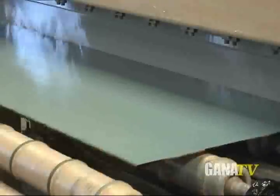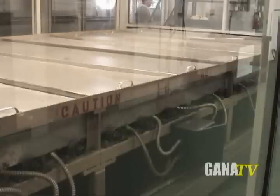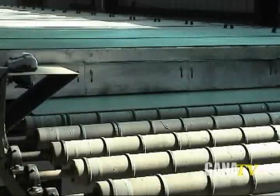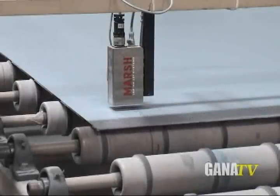An ultraviolet top coat is an alternative to a second layer of paint. After the application of the protective layer, the mirror is moved into the final oven section. The mirror cures in the ovens as it continues down the line, heated to a temperature of between 265 and 285 degrees Fahrenheit. The mirror takes approximately six minutes to move through the ovens and be properly cured. Once out of the ovens, the mirror back is labeled automatically by date and time of manufacture.